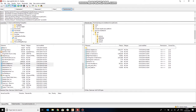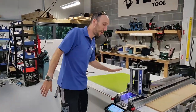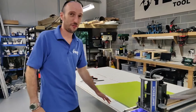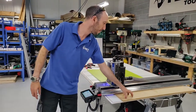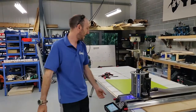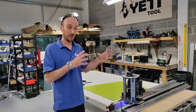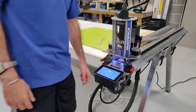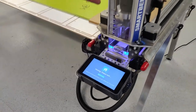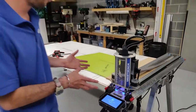With that done, our next job is to go up to SmartBench, set it up, and get cutting. So we've got our Corian here — lovely shade of green — a matching 12mm thickness piece of support for the runners on the upper beam, and a spoil board underneath because we're punching through. The gecko files are on SmartBench. First thing we need to do is home the machine — so that's the Z-axis homing.